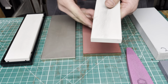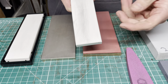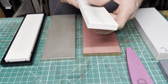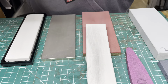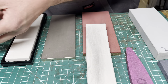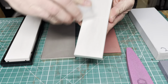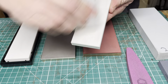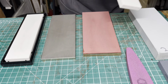They're incredibly hard, they don't require lapping, and they'll abrade just about any steel. They load easily and can be slow going as far as cutting, but they will create a highly refined, highly polished edge — there is no reason you can't get hair-whittling sharpness with these. I'll show you my fine; it hasn't been cleaned in a while. They do load quickly, and when they get loaded they slow down.